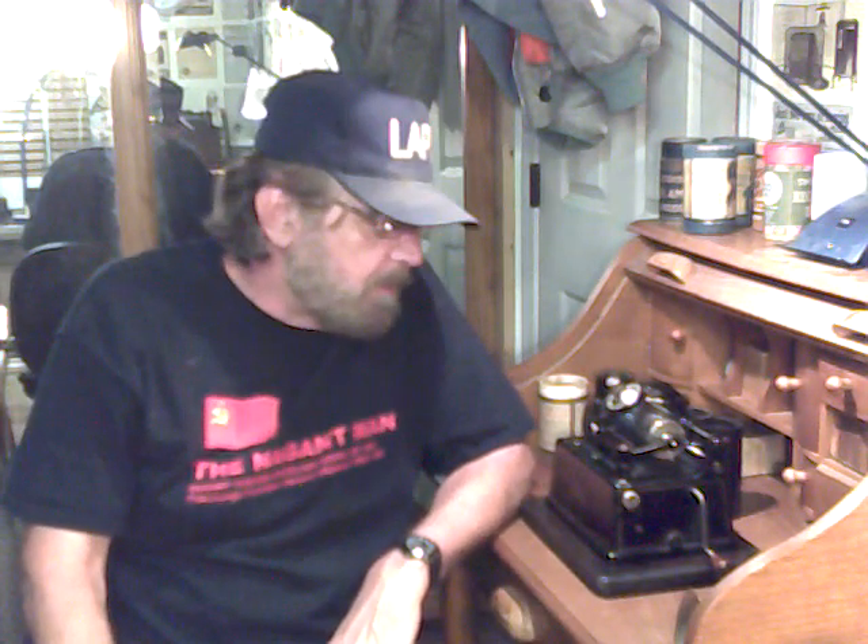These experiments I have done have paid off and I'm really pleased with the results. We're in the process of getting new styluses — the problem with these Edison recorders is that you can find the bodies everywhere and you can find the mica diaphragms, but no one is making a recording stylus. Nobody — there are none available, period, nowhere. Until now. The new recording styluses are going to be made of ruby rod — not sapphire, we're going to be using ruby — and we're negotiating with the manufacturer now.